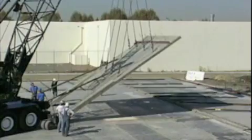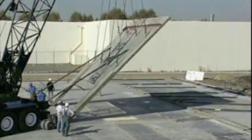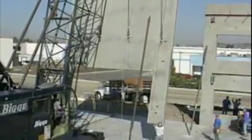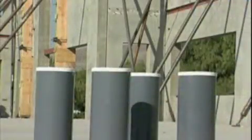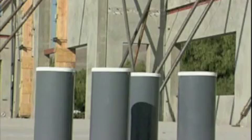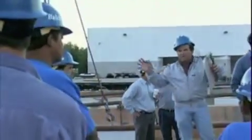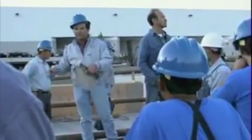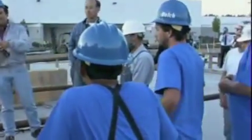The lifting day is the most anticipated and exciting day on a tilt-up job site. Panels can be lifted when the concrete has reached a predetermined strength, usually around 2,500 pounds per square inch. This is determined by testing beam or cylinder samples that were cast with the panels. Mix design, weather, and curing method can all alter the curing period. A meeting should be held before panel erection commences to ensure that all crew members are familiar with lift procedures and safety measures.